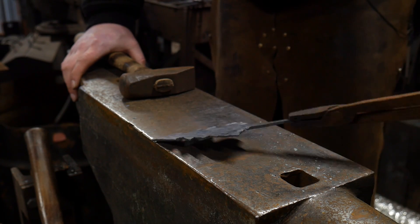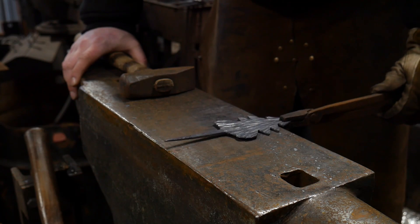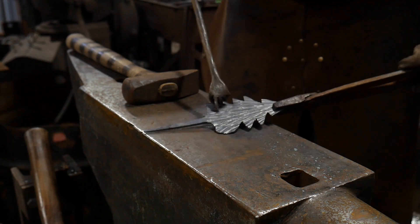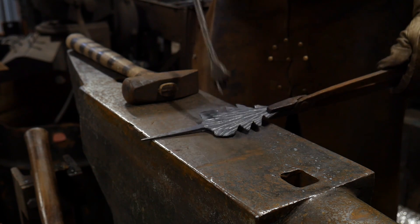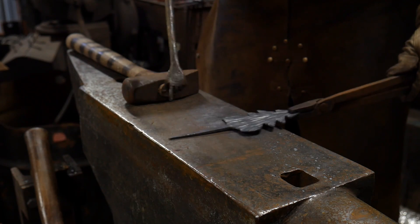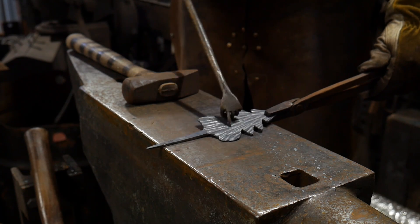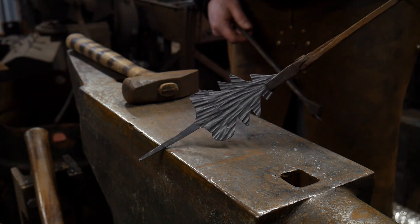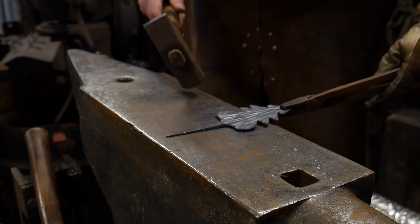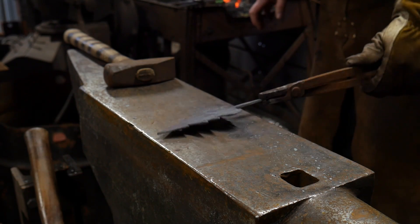You can choose whether you want to punch the holes or drill them. If you punch them, make sure you punch them undersized so that when you dome the piece the hole stretches out to the proper size. I just go ahead and drill them — I think it's easier to drill two holes in an inconspicuous way. Now we'll heat this back up, put a curvature in here, and finish off the hook so you can see how it looks when it's all finished.